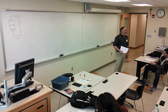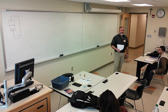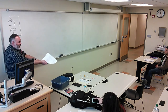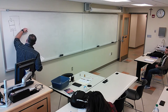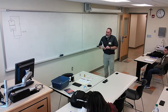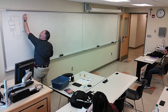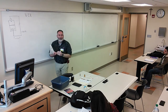And the electrons will flow, and they'll flow for about a minute, and then the battery will be done. Because the resistance inside this long piece of wire is extremely low. I think we measured that red piece of wire, and we saw that it was equal to about 0.1 ohms. It was really, really low. In fact, sometimes it read 0 ohms. And we know when the resistance is low, the current is high. We use this equation, the push is equal to the amount of current times the resistance, V equals IR.